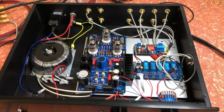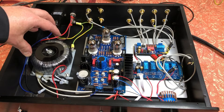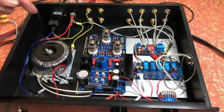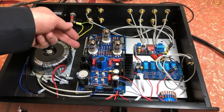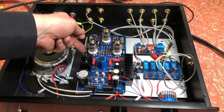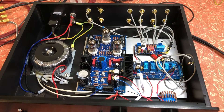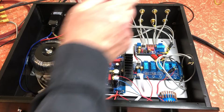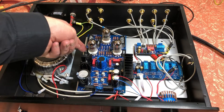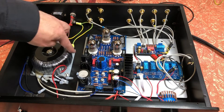The manual did say you need to keep the sensitive parts away from the power transformer, because they'll potentially pick up hum from it, and I think that is part of my problem. I can tell what's sensitive — I'll bring the speaker up so you can see. If I do the other channel you might even hear there's a bit of AM radio being picked up on that as well. My finger is a calibrated AM receiver. The channel with the worst hum is right next to the power transformer, and you can see that point is very very sensitive.